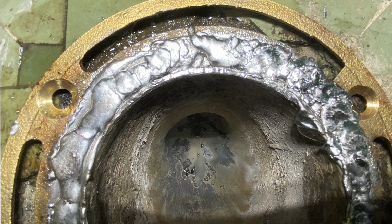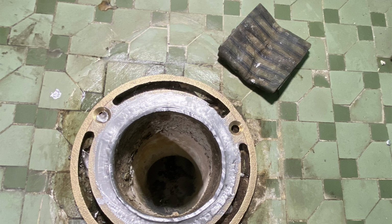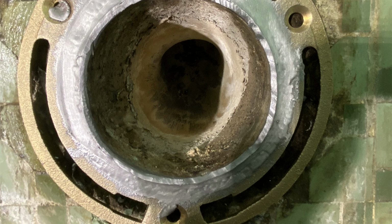And then the process is I'll take that wiping cloth, fold it in half, put some wax on it, and then I will heat the lead up, and you can see what I do is I wipe it. I actually wipe it. I push that down. I actually get that really, really shiny. I get that molten solder in there, and I have a pretty good technique of getting that solder melted without heating the lead up to the point where the lead melts. And that's it. That's the finished joint.